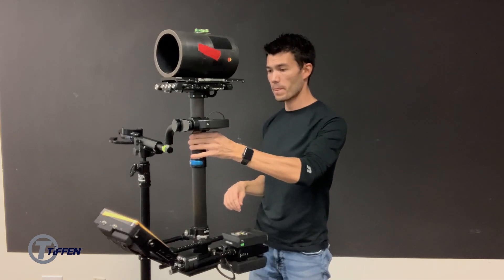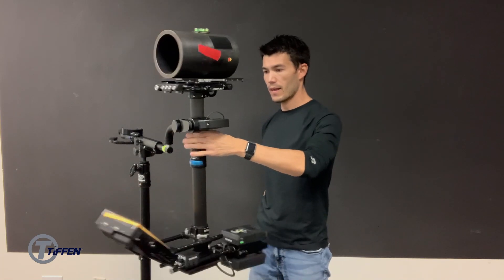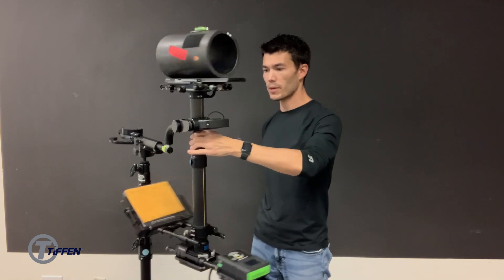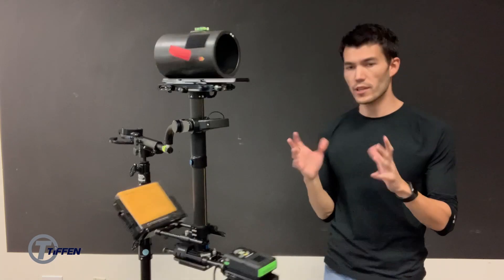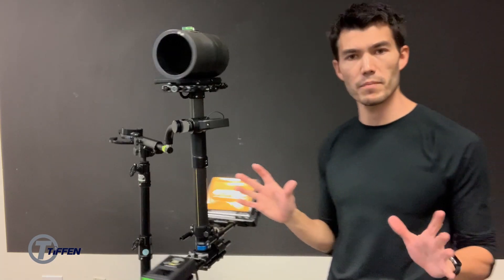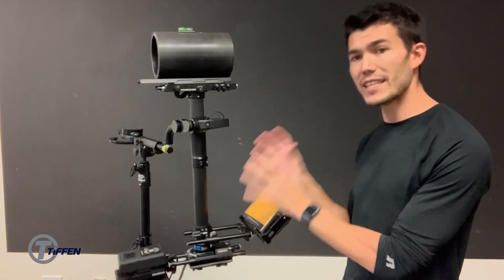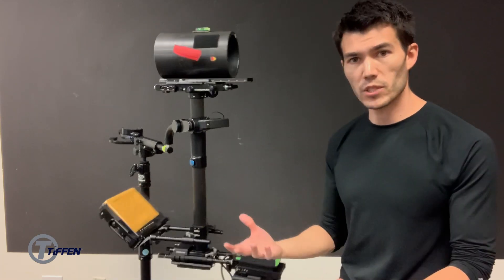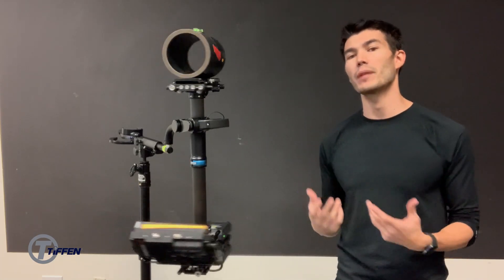So now I'll give this a spin. And as you can see, it is now dynamically balanced. I'll even release my hand here and let it free spin for a little bit so you can see that I'm not influencing it in any way. The only reason why this is happening is because the gimbal was center balanced ahead of time and then the bolt was added on. And because the gimbal is center balanced, it is able to overcome any of those irregularities that the bolt could cause to make it seem like it's not center balanced.